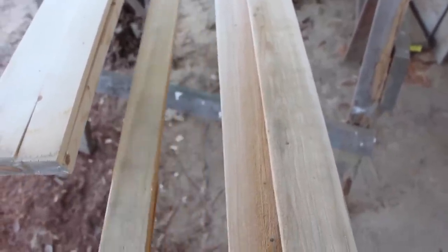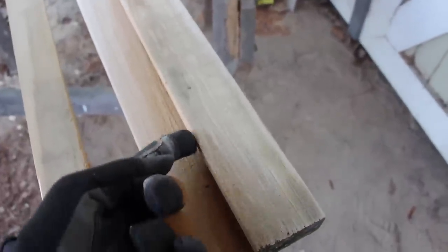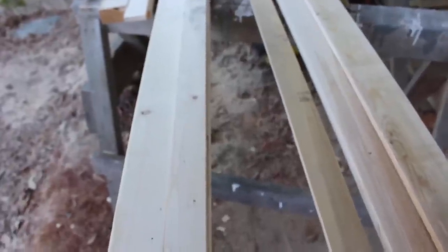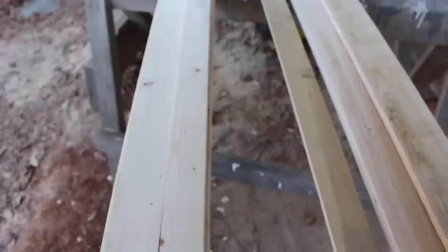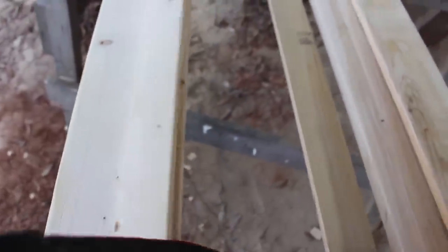I want to make sure this piece here was exactly a half an inch - this side is where the important part is. When I set the table saw up and ripped it that way, this piece of wood automatically falls off. Then you have a piece of wood which is cut all the way to the end, and on the end it has a half-inch groove cut up inside it. I ripped two of them because you've got a left-hand and a right-hand side to a door - you can't rip them both on the same side.